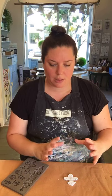Now with the glue you want to use — you don't want to use contact adhesive, which is what you use with the latex mouldings. It won't stick. I tried all the different ones. The best one I found was wood glue, just in the shop, and that stuck perfectly. It allowed me to move it around for a bit since it takes longer to dry, so I could get the right position. From experience, you want to have it as flat as possible and make sure it doesn't move. Then when it's all fully dry — the moulding and the glue — I would wait overnight, then paint over with your chalk paint, same as normal. You can just go straight over and then your gilding wax can look really good.